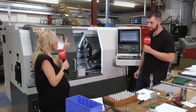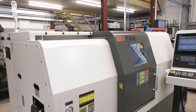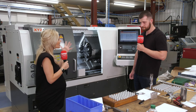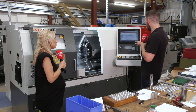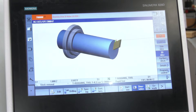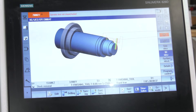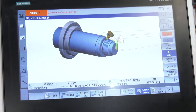I know you really like the software and the programming — what is it you like about it? Before filming, Nathan was telling me he likes to check over every part and make sure it's right first time, so does this give you confidence? Yes it does — it's got a simulation function. If I press that button there, it allows you to view everything you've just written to make sure it's not going to do anything you don't want. You can also check toolpaths for collisions, and that it's not going outside the job or pulling the job out.